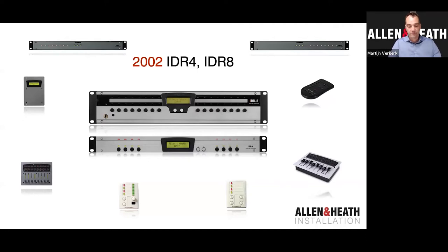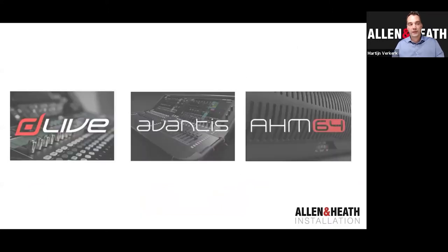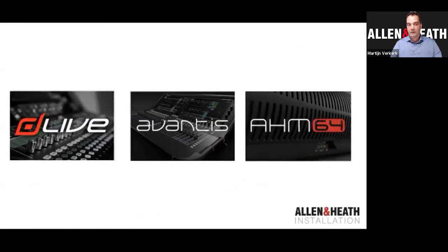So that was 2002. So we introduced for DLive to start with different kind of IP controllers. We stepped away from PLANet, and because Ethernet is a common protocol these days, we are using the layer 3 protocol, including PoE, to control our IP controllers. So the IP controllers work with DLive, Avantis, and AHM, and the power of that control is that it's fully universal. So any of those systems can simply connect to an IP controller and then assign attributes to a button or a rotary through a drop-down menu.